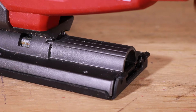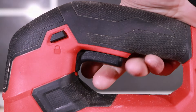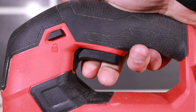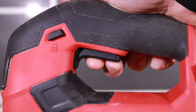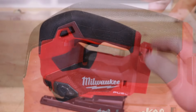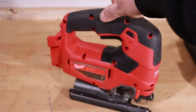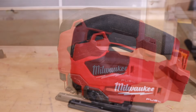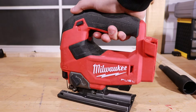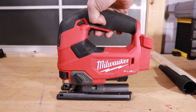If the bevel feature is important to you, you might want to compare it to the barrel grip because it's quite different. On the D-Handle you also have a lock button up on top and a variable speed trigger. The speed trigger has a very smooth action — you can start out really slow and rev it up to 3,500 strokes per minute. It'll slice through anything. I love the feel of this saw — I guess I'm just old school when it comes to D-handles. Heavy duty, over-molded grip on top, slip-resistant, just a well-built machine.